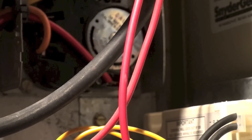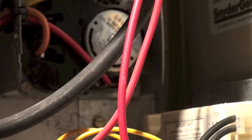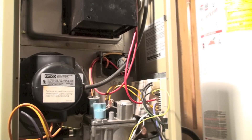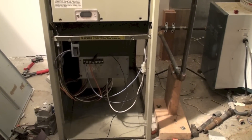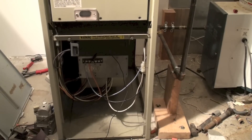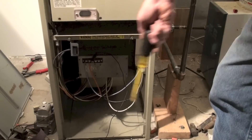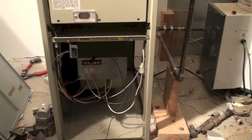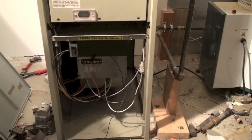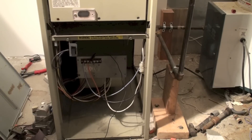You can see we have that same Honeywell switch we've seen in so many other furnaces — there's a fan and limit switch there. So other than the fact that it has a pressurized combustion chamber, it's not terribly odd. The blower is down below. There's a connection box with a fan relay, transformer, and the like in it. That's how this thing is put together. We'll start looking at how the burners burn in the next video.